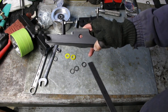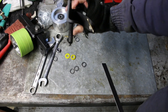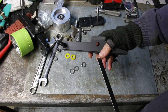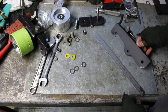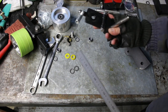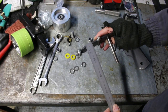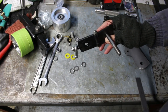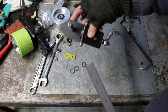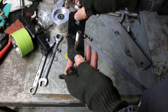That's your adjustment hole there for the bottom part, and that's where we put the top on. On here I've made up this piece — that takes the dual axle part on the top. I've gone to 8mm now on the top just to make it a little bit bigger. The wheel attaches to the hinge. What I've got is a 50mm flat bar by 6 — the angle iron's 6mm thick too. So those are my two hinges. I've made them up with a round bar in there and drilled them out for the 8mm bolt — put them in so they hinge. I've welded that up.